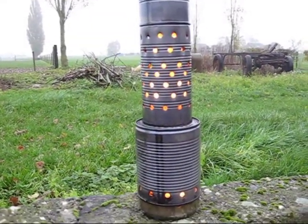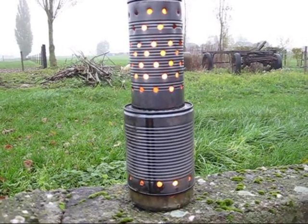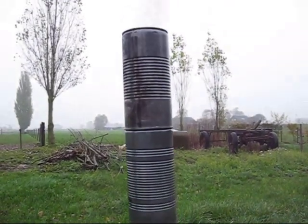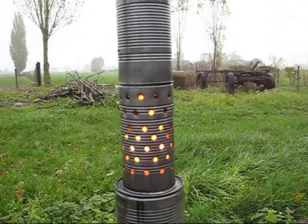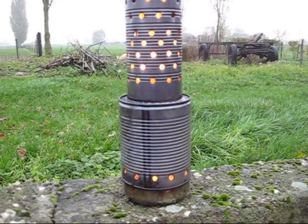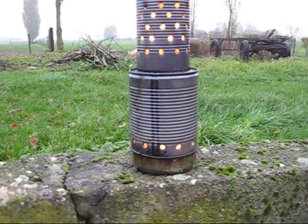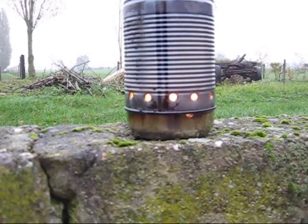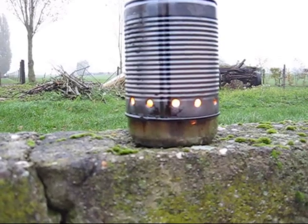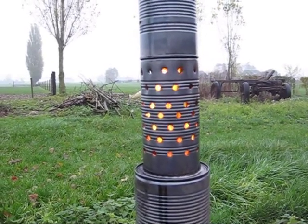After about 10 minutes it's fully functioning. The oil is boiling — you can hear it. I have the flames in the right place, but there is a little bit of smoke. I know for sure this is because I have too much oil in the burning chamber. When I make a drip system, the smoke will be gone. It's burning beautifully now. You can see it in the air holes — it's taking air there and making its flames almost blue. It's burning very quietly and very slowly. That's what I like.